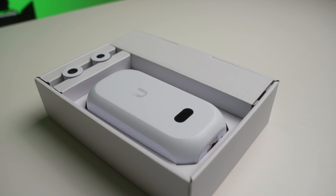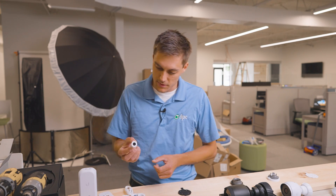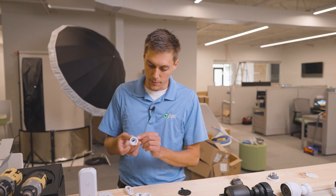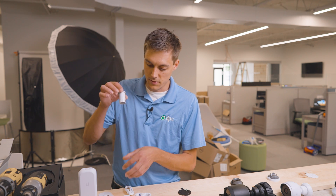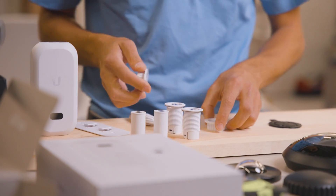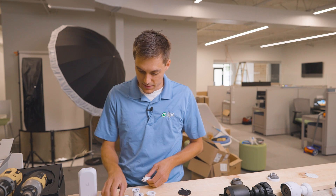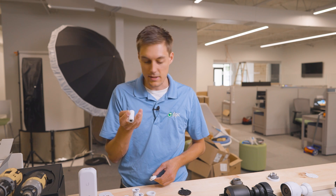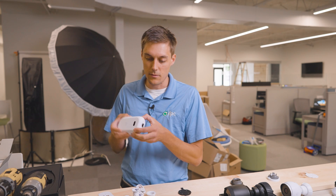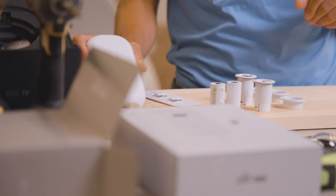The AI Theta is going to be the most packed-up product we have here. It has a bunch of little pieces — these cameras are incredibly small. There are different mounting brackets depending on where you're putting it. These remind me of the older style UniFi cameras where you'd slip the tube into the ceiling tile and mount a bracket underneath. We're going to have to drill some bigger holes for these. These cameras also use USB-C, with two ports and a PoE coming in on the back side, so you can mount above the tile and have the USB-C popping right through for a nice small camera footprint.